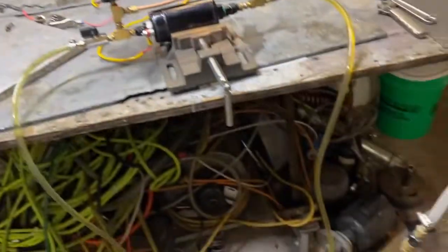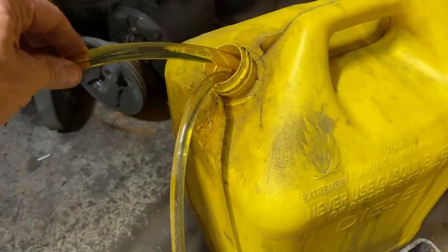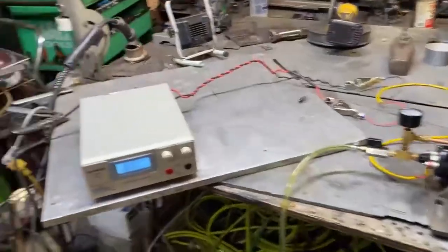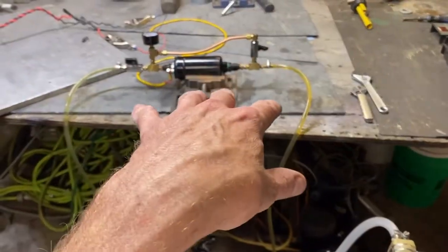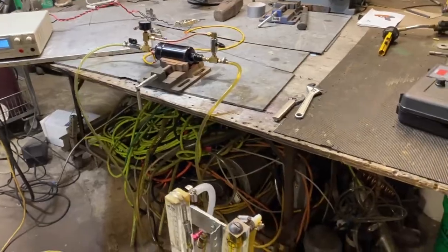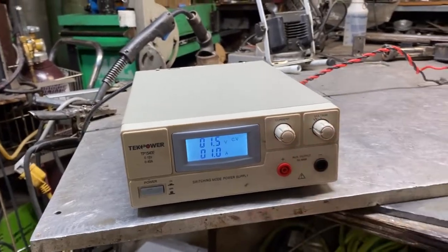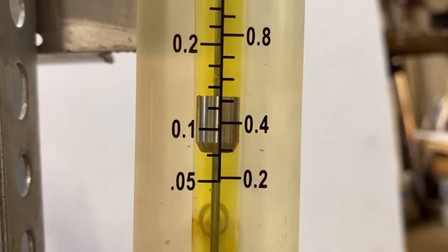Very hard to do it at even smaller flow rates. That is a lot of power we're pushing right there, but when it comes to very small flows this still isn't doable — and this is a huge problem when you're looking to get a very small flow. At two volts on this transformer it's not a very ideal setting. Motors don't like running on such low current; the slightest little air bubble can disrupt the pumping action and it cannot reprime itself at such low operating levels. I'm going to attempt to bring it down to 1.5 volts — it may drop altogether. Looks like we're about to drop it, but as you can see with this transformer we have some very smooth flow action.